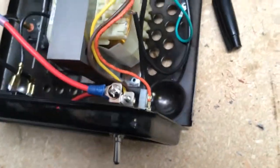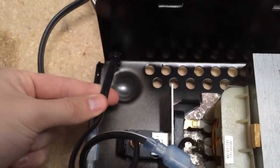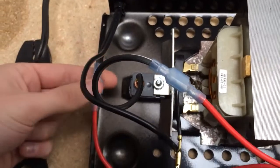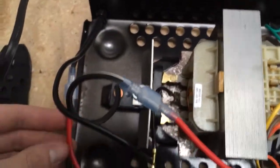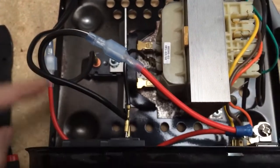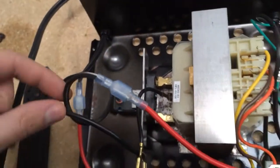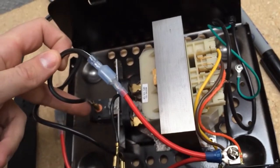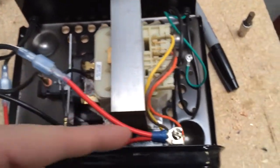There are two terminals on the back and all you're doing is interrupting the circuit itself. Here are the two wires to the alligator clamps. All I did was splice into the positive — the white cable, denoted here. I decided to break it at the positive. The positive original cable going to the alligator clips feeds into the lower part of the switch, and the upper part of the switch feeds from the transformer into that spot.